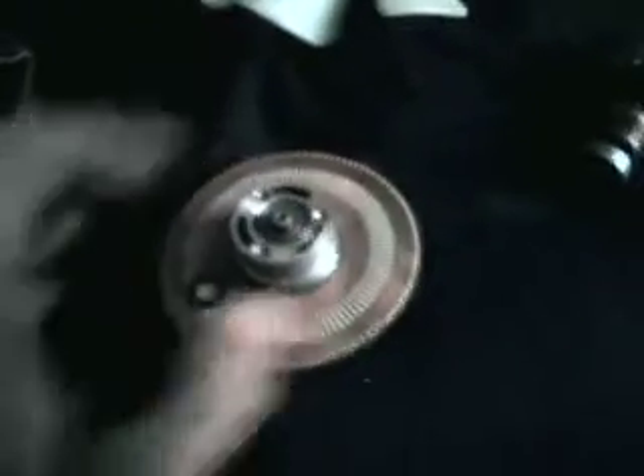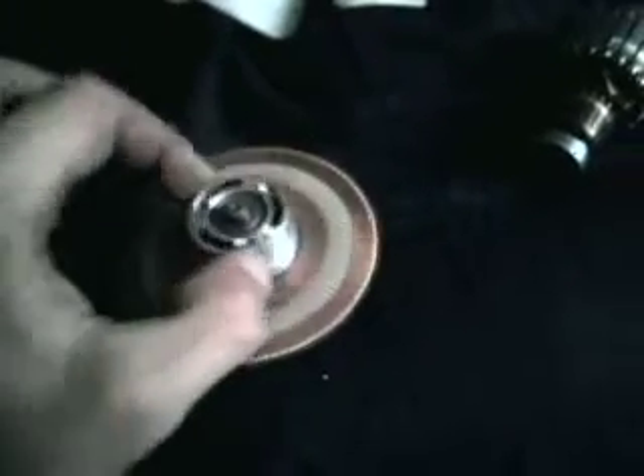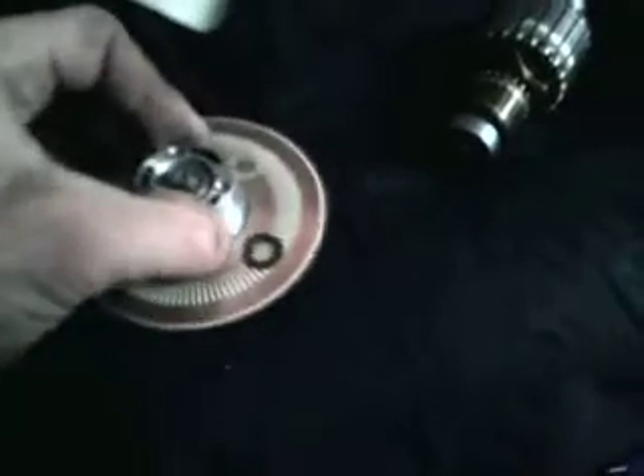This is a hub for this one here. This one's got bearings which are press-fitted. This one here is a brass bearing, so I need the metal hub to go on. That's important. This is a brass hub — there's no bearing, it's just low friction — but I don't want to lose these pieces. Due to some work it grips slightly.